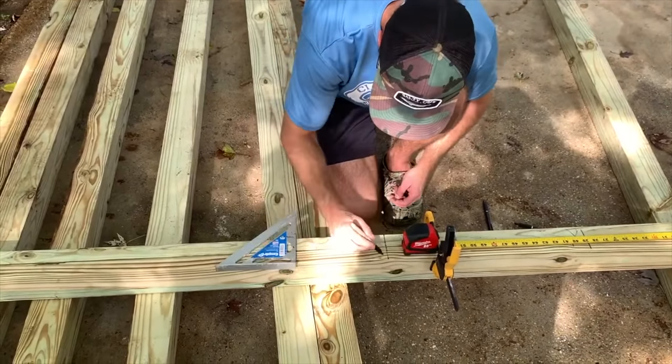Now, a drip edge is typically made of a non-corrosive metal, and its purpose is to direct any water runoff away from the shed. I'll link the exact drip edge I used in the description. When installing a drip edge on the eave side, I recommend that you take some snippers and create a bend just for a couple inches at the corner, and this is gonna basically create a corner that's gonna catch between the eave and the rake edge. And that way, when you install the rake drip edge, it will go on top of that and prevent any water from getting behind the drip edge.